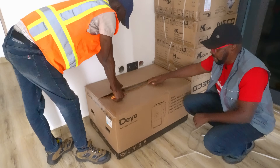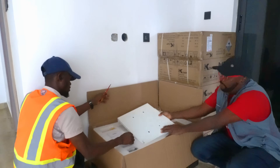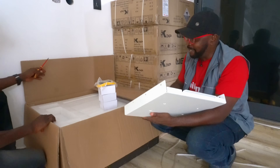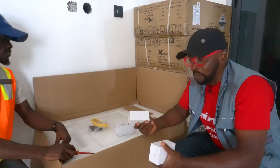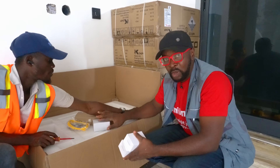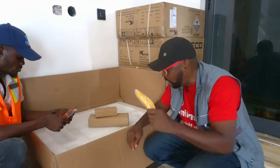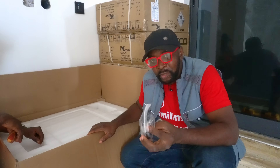I'm sure it's going to do a good job. It has an output of 250 amps. So the first thing you're going to see right here is the mounting plate. If this is meant to be on the wall, then the inverter will hook right onto it. This ensures solidity, because it's going to be a real disaster if you have your inverter on the wall and you go to work and come back and it's lying on the floor. So these are the current transformers, because it's a three-phase system, it comes with three current transformers to be able to monitor the current on the three phases.